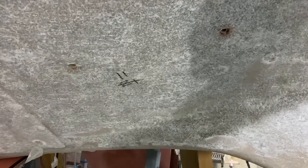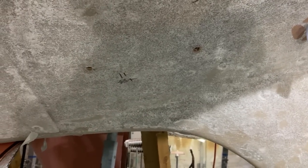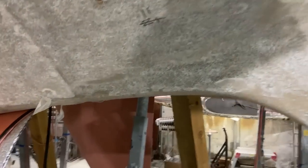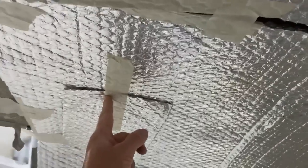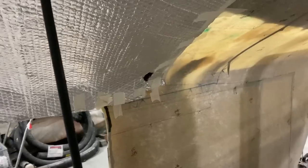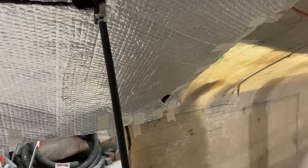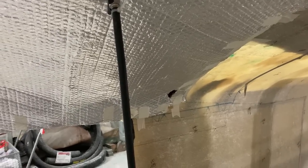You'll possibly remember from earlier videos, this boat had two huge anodes, so I've got four anode stud holes which I'm going to fill and glass up. There's also going to be a change to the location of the, can't see it. Under there is the old seacock for the engine inlet, and we're going to be moving it down there, so it's closer to where it is on the newer boats that are built, and it'll be under the step as you walk into the boat